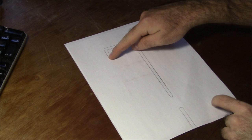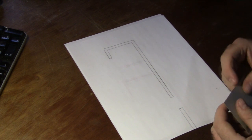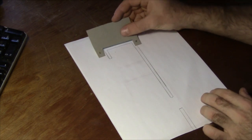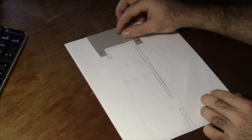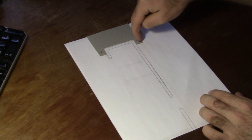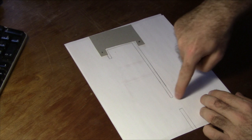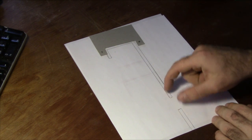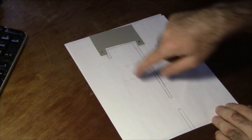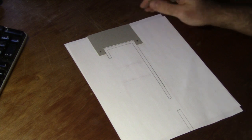So my old balcony railing had a cross section which looked something like this, and it was quite easy for me to mount my owl on there. All I had to do was notch out the bottom of the owl so that it had the same shape and size as the bottom of the railing. Then I drilled a few holes along the sides, and I had three pieces of rope which looped down and around through here. There was a little gap down here between the main railing and the bars which were lower down, and that was a good spot for the rope to go through, and it made mounting the owl on my old railing really easy.